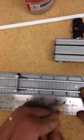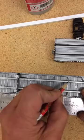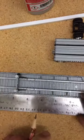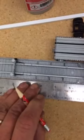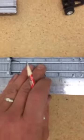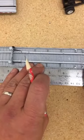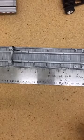So all we're going to do here is go over and just measure 5 and 5/8 and then make a mark right here. I'm looking for these two things when I go to cut. You can use a hacksaw, you can use a Dremel — it doesn't matter. Use something that you happen to have on hand. You can use a coping saw, then file it smooth and level when you're all done. That'll be great. You don't need fancy tools. Do not let fancy tools keep you from building cool models.